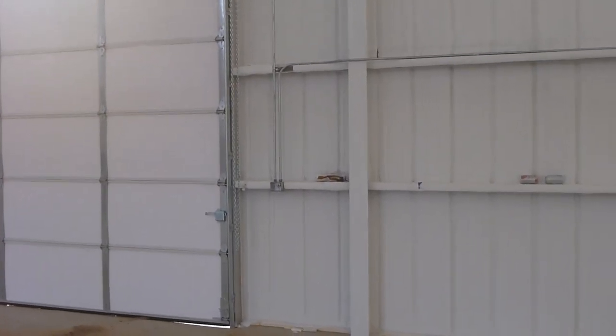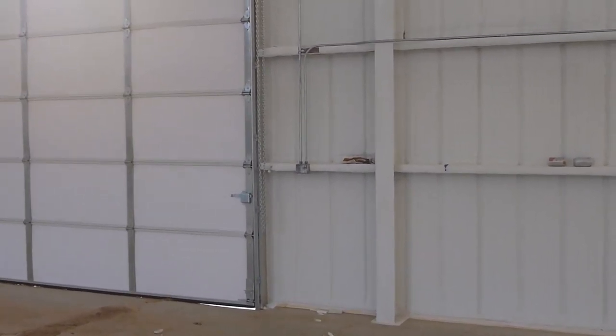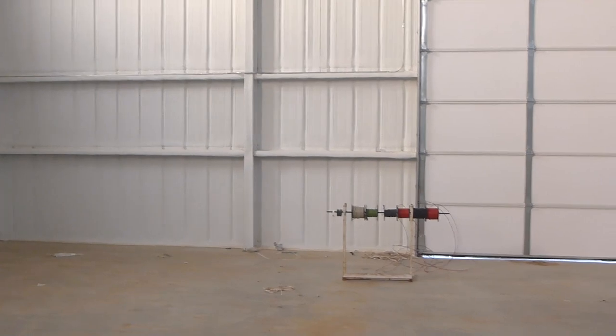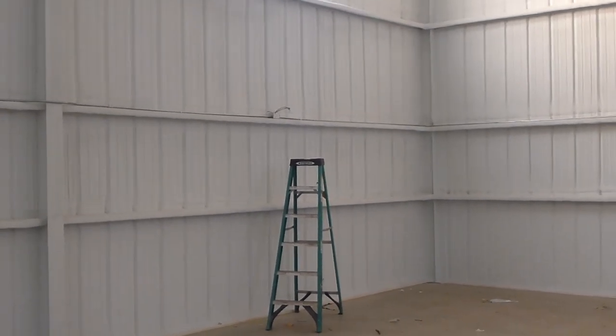I'm going to go up and feed all the way across to the light fixtures. I'm using 12-gauge solid wire and I've been running four conductors through there. I'm going to run ground and neutral separately in different conduit to these boxes, but I'm running four number-12 solid. The conduit capacity, as I understand from the NEC, is nine conductors in half-inch EMT conduit. I've been having a bear of a time trying to pull these, which is why there are junction boxes — I wasn't able to make the pull in one straight run.